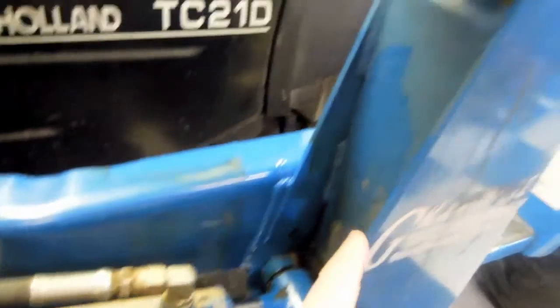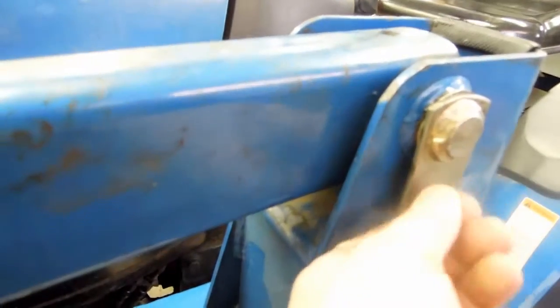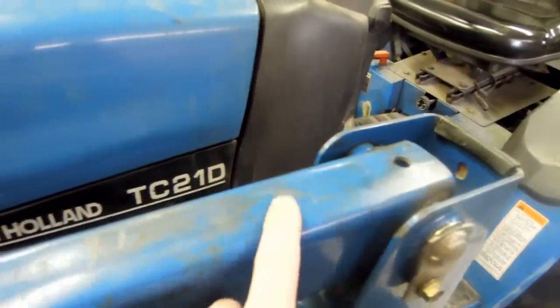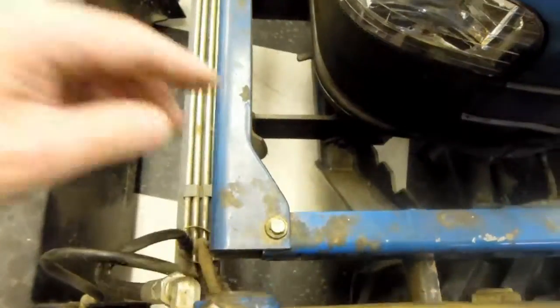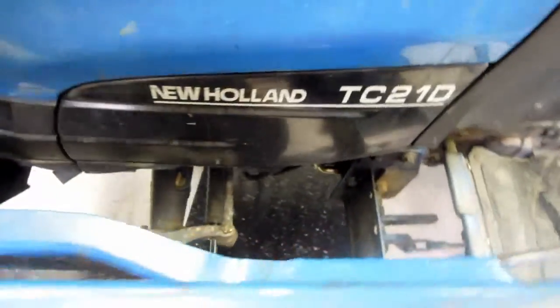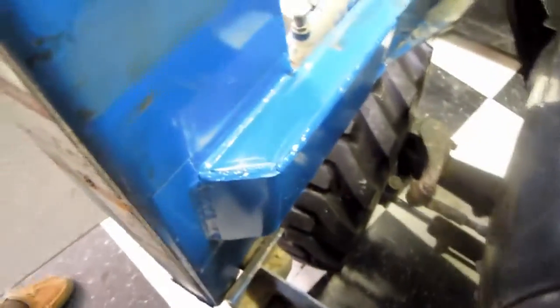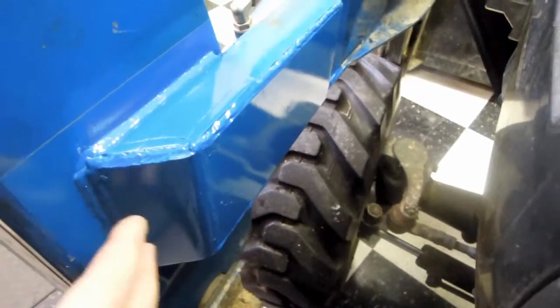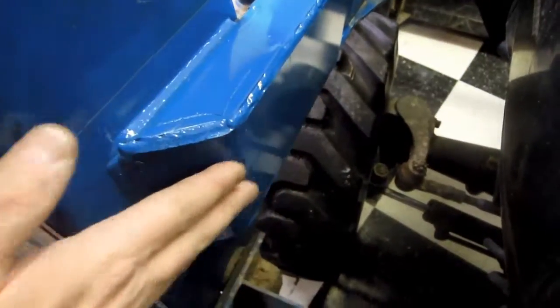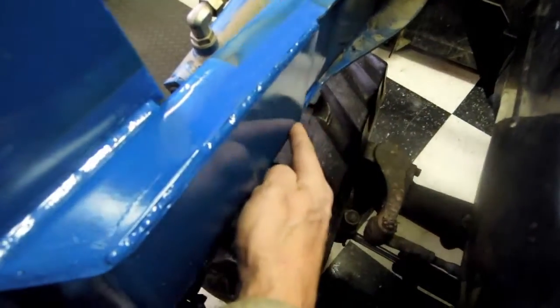This pin had to come out here, and this pin had to come out here. These bolts just come out and then the pin you just tap out from the inside to the outside, and then it's free. The cylinder here will be free, the top of the beam will be free. And then you have to undo these bolts to get this top piece of the frame out, and then you can just pop it right out. The inside of the repair — where the serious work was done — is right here. The welder plated it with a nice curved plate here. He made a whole new plate; this plate was not here before. So they straightened it, made a plate, and then welded it in place.